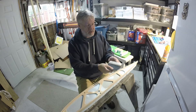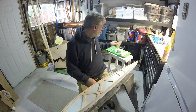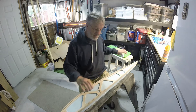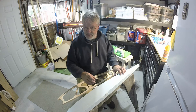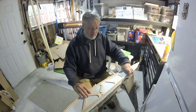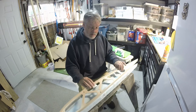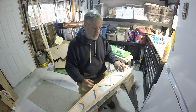So I was on to plan B. I have had this for a while — one of those rubber tacos, as my body shop called them — that you can stick a five or six-inch disc to. Then I came home, got some pink foam and a hot wire cutter, and started making shapes. This is my first attempt at hot wire cutting foam. I made this mandrel that I could support the rib on so I'm not putting any load on the cap strips, and I could clamp it if I had to. It's two-sided so I sand one side of the rib, flip it over, and go to town on the other side.